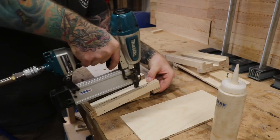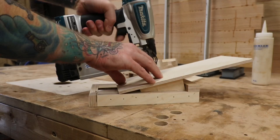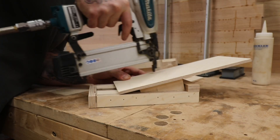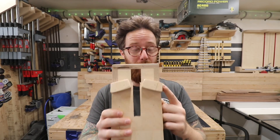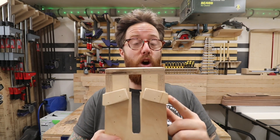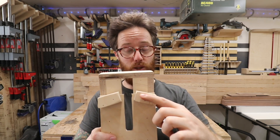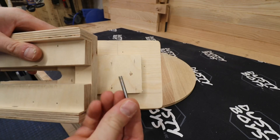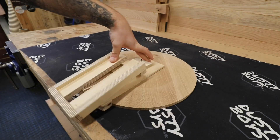Attach the wedges to the underside of the base, then slip your base-base on and attach that — again, this could all be done with screws, brads, CA glue, or bog-standard wood glue. I then attach some blocks to the underside of the base-base to avoid it slipping about when in use. This works well if you're using the jig on a straight edge, and on curved pieces I just angle them slightly to accommodate that curve. You can also add a pin so the jig can pivot around on circular pieces, which I ended up doing here.